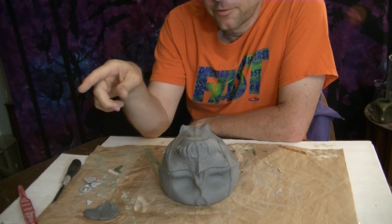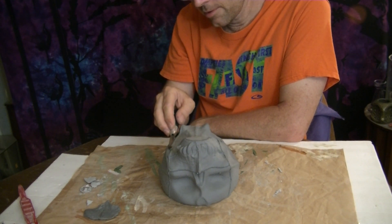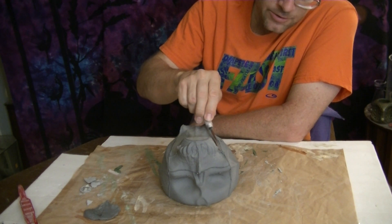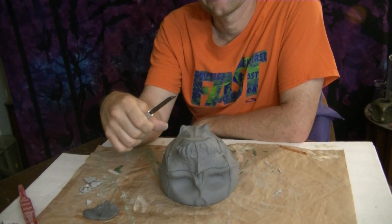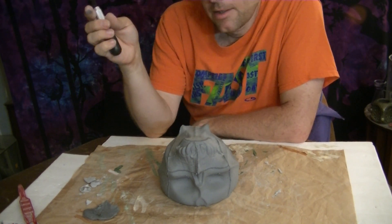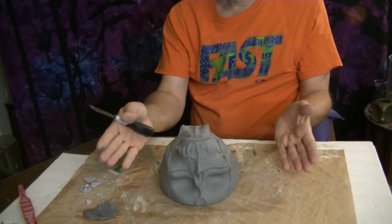Once it's firm enough we'll flip it over to dry further, and then we'll be coming in with an exacto knife, a sponge, and some water. We'll be removing these mold lines, which you have to deal with to some degree on any molding project, and then smoothing them out by lightly dissolving the surface with a damp sponge or cloth. There are lots of little imperfections on this. I don't know if we'll do a video on it or not, but at some point I'll pick this up and show you as it comes along. That's it for this step — here we have our piece out of the mold. See you next time.